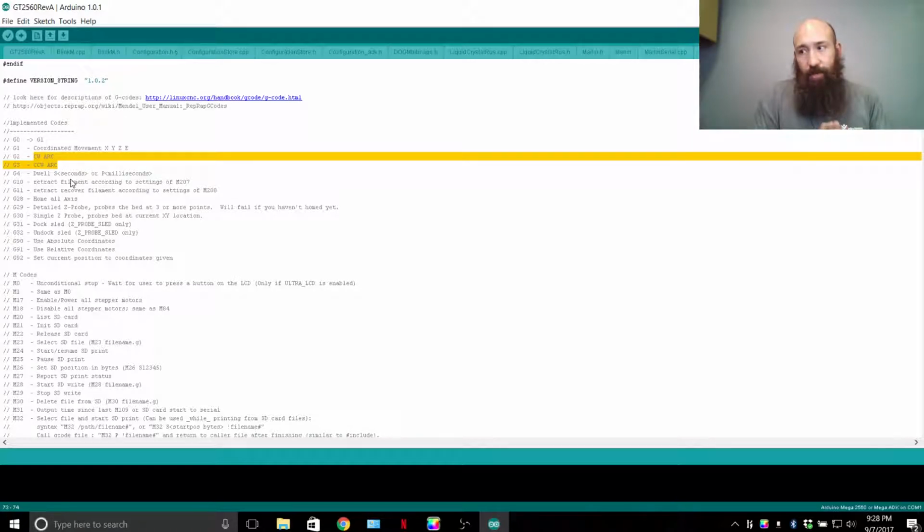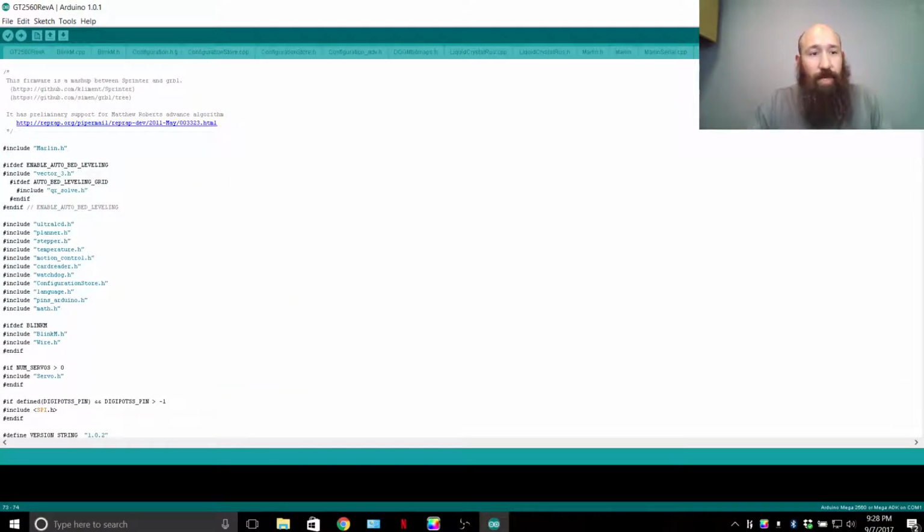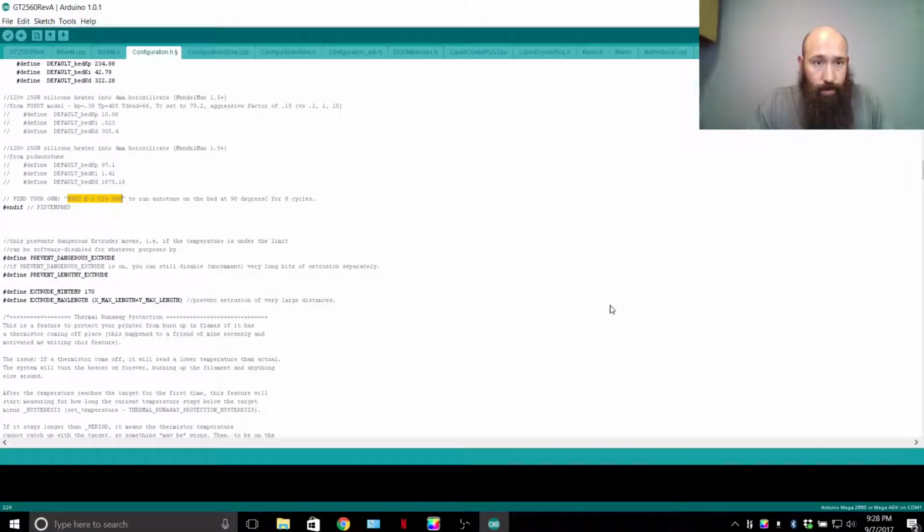G-code, those CNC machines, they utilize the counterclockwise and clockwise arcs. It's actually really good for circles and things like that. However, in 3D printing, the way slicing works and extruding works, they don't utilize that feature. It's a series of a bunch of straight lines with a certain amount of material to be extruded during that movement. So that's G-code in a nutshell.